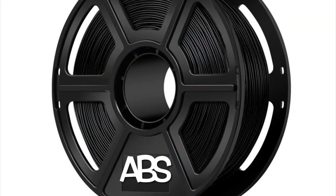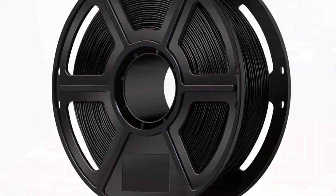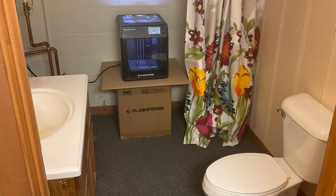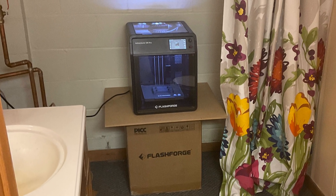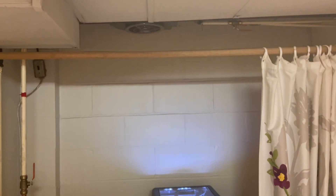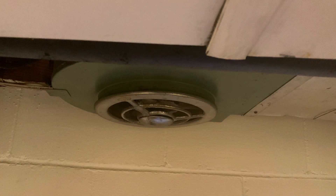Because this is going outside, I want a higher-temp filament, so I chose ABS instead of PLA. ABS can produce some really nasty fumes and gives me a headache, so I needed to put the printer somewhere with really good ventilation. I chose the little bathroom in the basement because above the printer there's a really good vent that goes all the way up, so nobody has to smell the fumes.